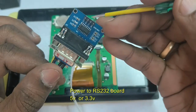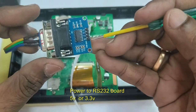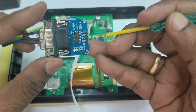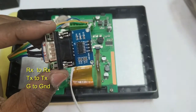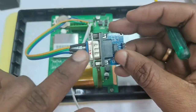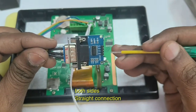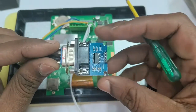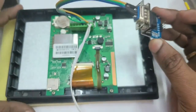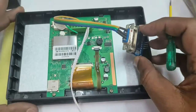The other end is connected to an RS232-to-TTL board built on the MAX3232 IC. It requires a power source and can work on either 5V or 3.3V — you can supply it from the Arduino itself. The connection is also straight: RX to RX, TX to TX, ground to ground on both sides. The connections are never reversed on this board. This is how to access data using DWIN. Thank you for watching.